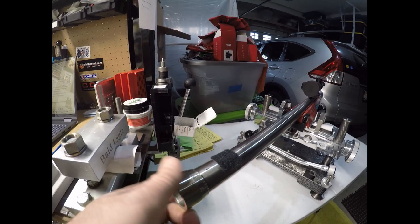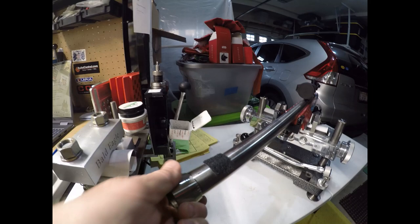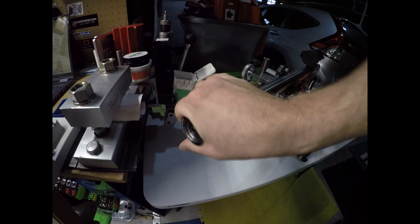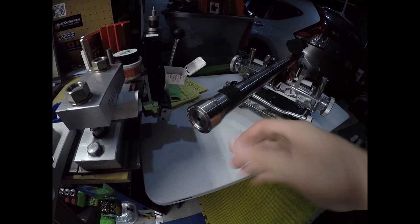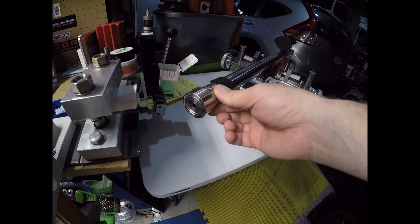So easy to screw on from there. And then right here is right around where that O-ring is now engaging on the barrel, that small part that we turned down. And then we just turn this thing all the way onto the barrel. As you can see, I'm turning this all with just my hand force. There's no additional force applied to it. So it's all pretty easy to turn. Okay, and there you go. No set screws, no nothing, just turn it with your hand power.